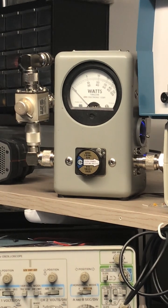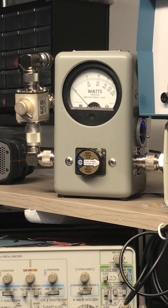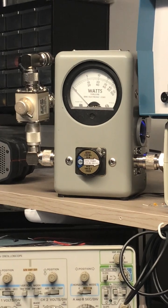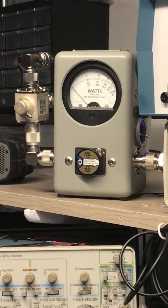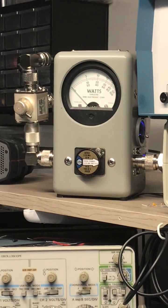Galaxy DX959B with a PPE asymmetrical modulation in it, and like I said, that's variable. You can get it locked down, or you can get it with a switch if you're comfortable with that. But you just have to be very, very careful. Pay attention to what you're doing if you have the switch, because you don't want to be keying that radio up at 8 watts, or whatever the radio gets set at. It's a single final radio, so 4 watts, and swinging out. That's just going to burn up the amp, so it's not what you want to do.